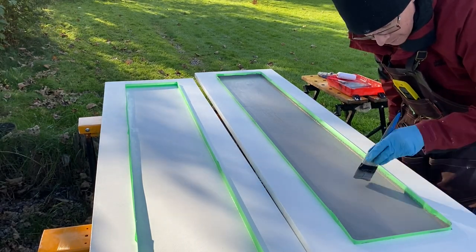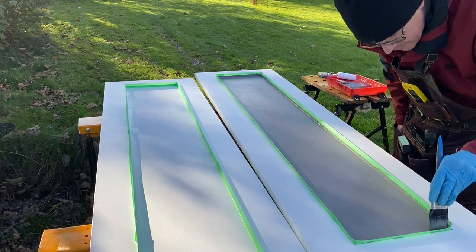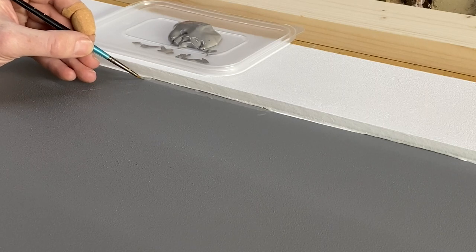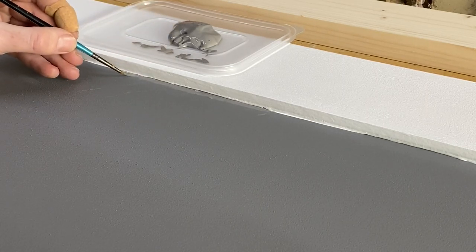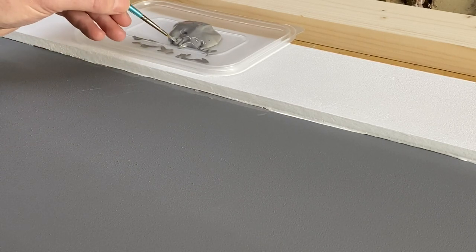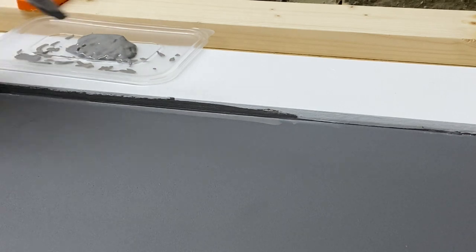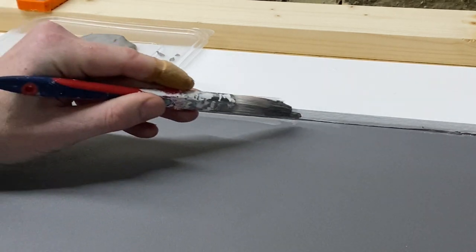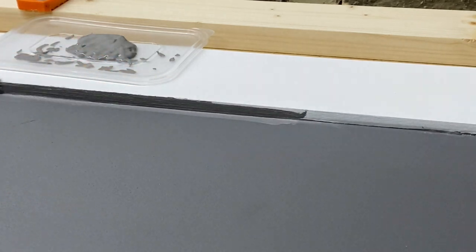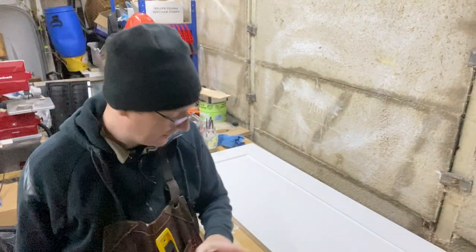For the gray finish, the emulsion on the inside was painted on and then lightly gone over with a roller to give a nice uniform finish and get rid of the brush marks. The problem was when I took away the decorator's tape I wasn't happy with the edges, so I borrowed one of Pam's art brushes. My left hand wasn't happy with it either — it looked a bit of a mess. So I decided to paint the inside ridge all the way up using a wider brush, which allowed me to wipe along the top and gave a really nice clean line. I was really happy with the end result.